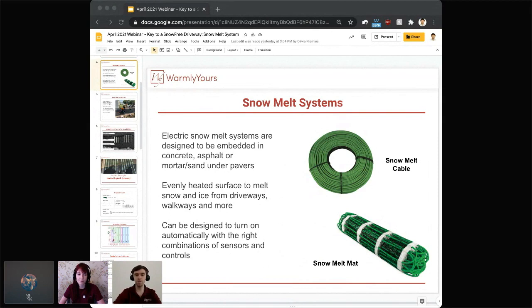Great, thank you very much, Lynn. I'll probably just quickly add here, quite a common question we are getting here in tech support is what's the difference between cable and mat, or when should I use the cable versus mat? Technically speaking, the loose cable that you're seeing on the screen is the same heating element that is already pre-spaced and pre-attached in the snow melting mat at the bottom of the screen. Larger rectangular areas would be quick and easy to work with the snow melting mat, because you can unroll that and get your large area covered pretty quick and easy. Snow melt cable would be a good product to use on anything like stairs or any kind of odd shape, maybe walkways or sidewalks, anything that would have some diagonal sides or just simply a curved walkway. That's where you're getting more flexibility using the cable and making sure that your area is nicely covered.